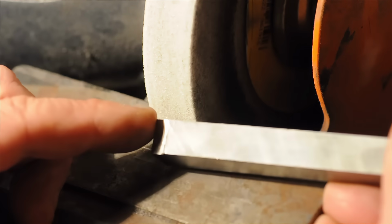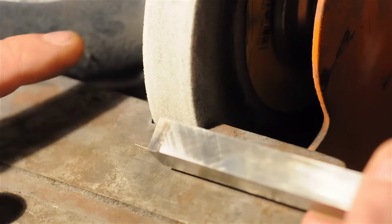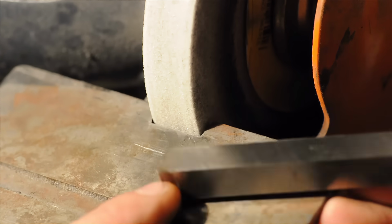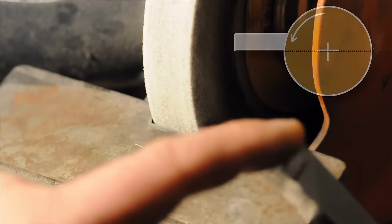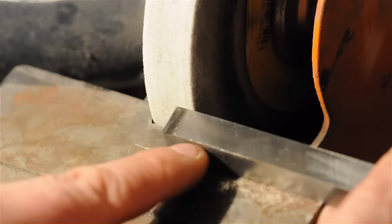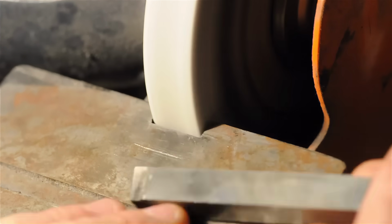With one grind, I'm going to try to get both of those angles. Now I'm on the fine side of my grinder just because the tail end of the tool touches the body of the grinder and I can't get the angle that I want. But if I were to grind this, this is our cutting edge. This is the top face we want to grind. If I pick it up and I grind against the wheel while I'm on my tool rest, it's going to cut a scallop, right? It's going to be sort of that rounded shape where it's lower in the back and higher in the front. I also want that top angle to lean back a bit, so I'm going to turn my tool about 7 degrees up this direction. I'll grind this and we'll head back over and look at it in the vise.